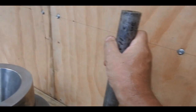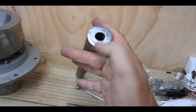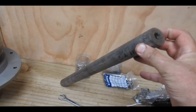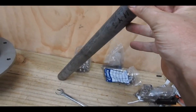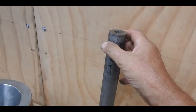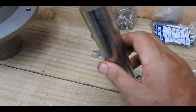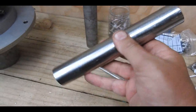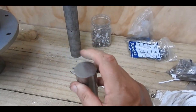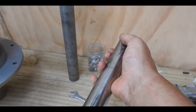Moving on to this little piece here — we've got about one and three-eighths inches diameter outside, and inside is just a little under three-quarters of an inch. My idea is to use that as the air feed, or at least some portion of it. Maybe half standard steel and half stainless steel — this is 316 grade like everything else. My idea is to feed the air from the intake down to the burn zone, about that much short of it. Then a piece of the same diameter but free of holes will be used to form a nozzle. I'll drill a ring of holes around the perimeter of it and one at its end, and machine it so it just plugs into that — a bolt, Frankenstein's neck bolt sort of thing, holds it in place.